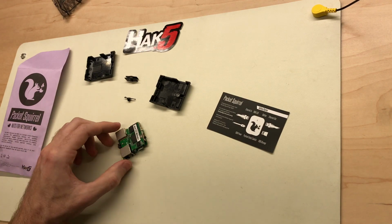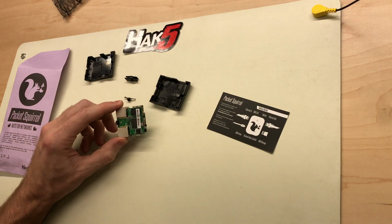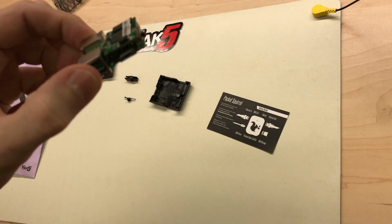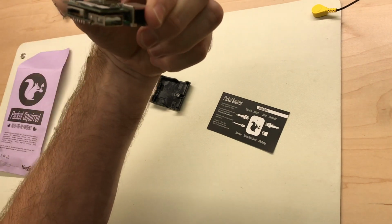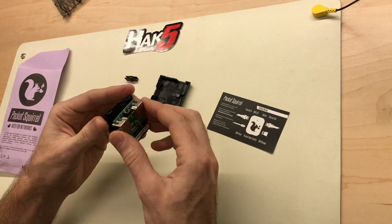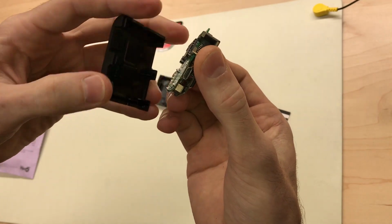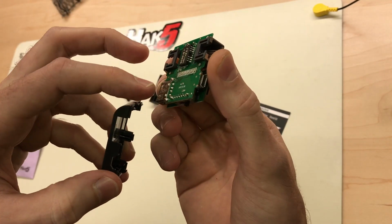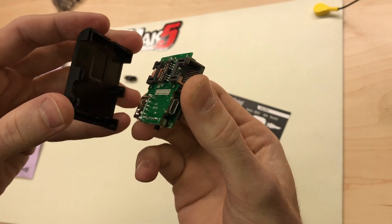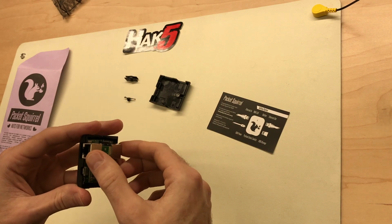So let's figure out where we're going to put the power supply that's going to change our 48 volts power over Ethernet to 5 volts, which this little guy wants. There is a lot of room in between the 2 boards, so I might look at maybe getting something in between there. I've looked at the clearances on the case, and there's not a whole lot of room. There is a little bit because of the solder, or because of the tabs and leads sticking up from switches and RJ45 ports and things like that. So there's a little bit of room right in this area, but it doesn't look quite thick enough for our board, which has a pretty thick inductor on it.